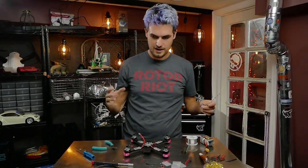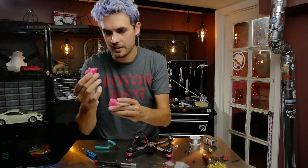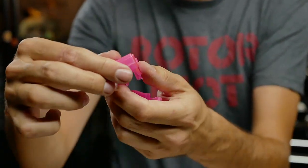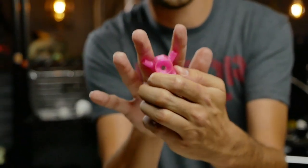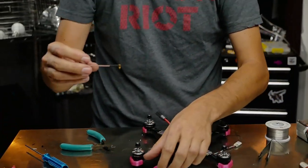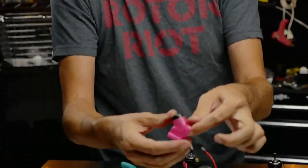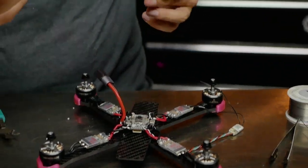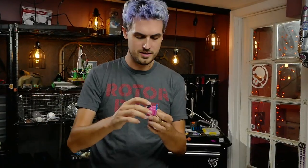Let's put some thought into how our antennas are going to lay out and work from the antennas inward. We've got a couple of different mount options from Brain 3D: one holds receiver antennas plus an SMA hole, another holds a T-style antenna in a ring plus another SMA hole. I want to use this one — we've got our two antenna holders and it fits perfectly with our Lumenier AXii. We feed the connector in and the antenna fits right into the holder.